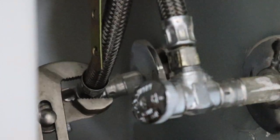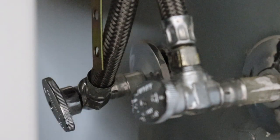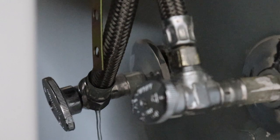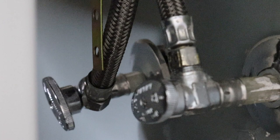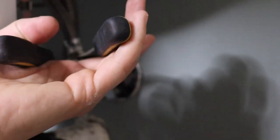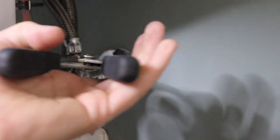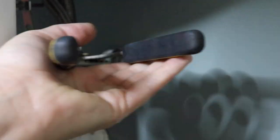To help achieve a more modern look, I'm going to be replacing the current pedestal sink with a brand new vanity. The first thing I did was turn off the water supply to the faucet, then used channel locks to remove the valves. I made sure there was no pressure inside the faucet before removing the valves — some water did come out, so make sure to have a towel or bucket available. This was my first attempt at any sort of plumbing and I'm quite happy I didn't have any floods or pipe bursts. I turned off the water supply and everything was smooth sailing.